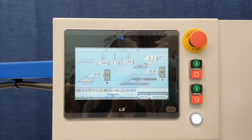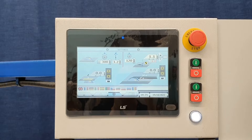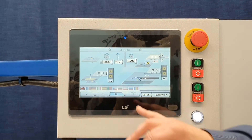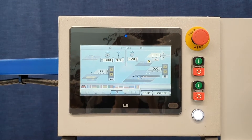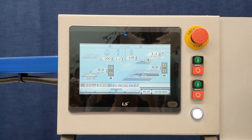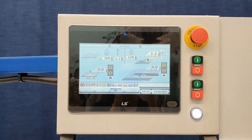This is the settings menu. When you change your blade, the machine will ask you to update the parameters. Here we have the diameter size and the blade teeth thickness. When you get your blade sharpened it obviously shrinks, so you will need to adjust it. That way you don't have to worry about the rip fence going out of calibration — it will always be accurate.